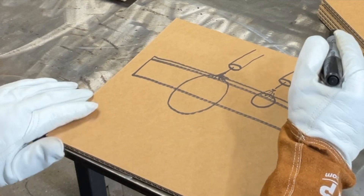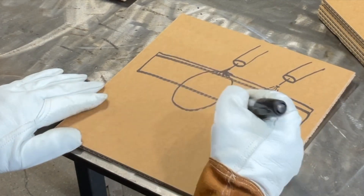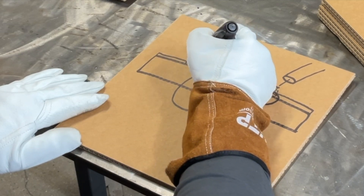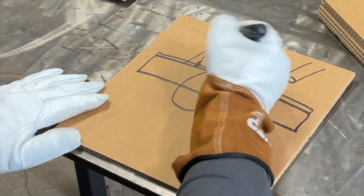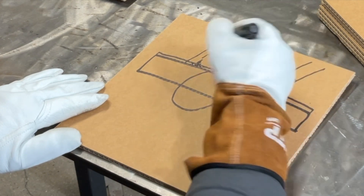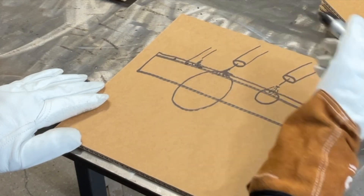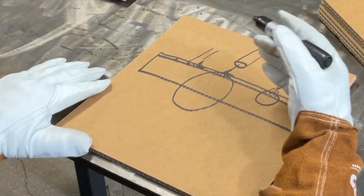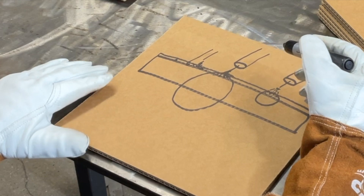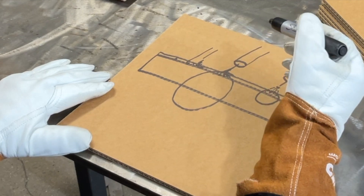Now there's always someone who says they can weld short circuit on aluminum with their spool gun. If you weld short circuit on aluminum, the wire short circuits, burns back a little bit, then your welding arc establishes — it's just a lightning bolt attaching to the oxide layer, like bubble gum. Maybe you get a piece that connects here and there but you don't have good noticeable penetration inside creating a good bond. For sure this will not be leak tight, and in a structural application it's prone to crack — it will crack. There is not enough fusion on a short circuit weld to be worthwhile.